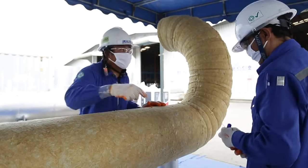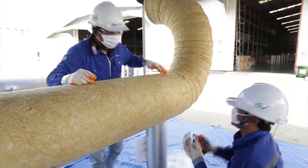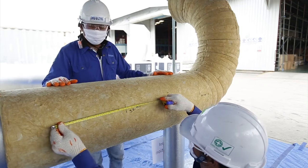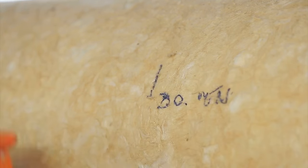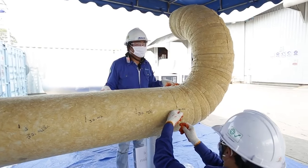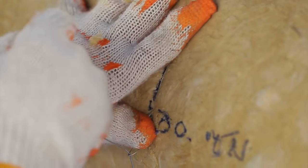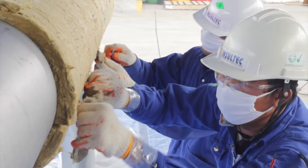While installing the Rockwool Pipe Section on the straight pipe, 10cm should be left from the elbow in order to fasten the insulation with wire or bands according to the installation standard for industrial insulation on pipe. Continue marking points at 30cm from the first point and continue until the end of the pipe, according to the installation standard for industrial insulation on pipe, to fasten the Rockwool Pipe Section firmly to the pipe with steel bands or wire.